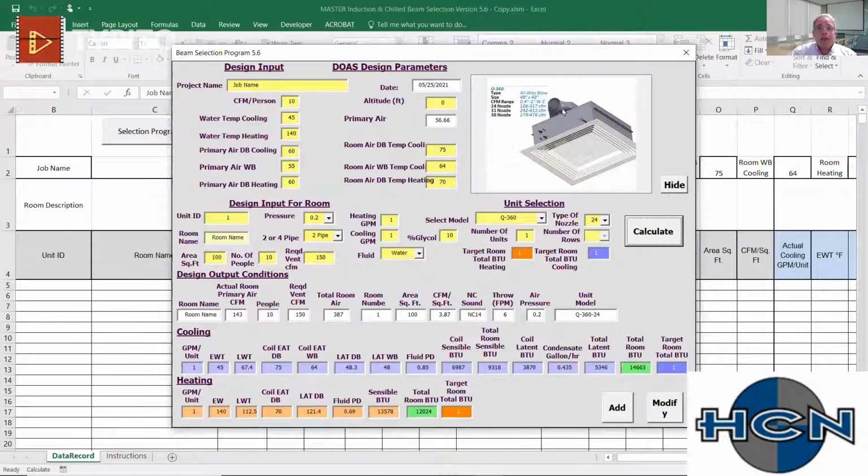And you would measure that static pressure at the exact same place ETL would measure that static pressure. On the low end, it's 143, and on the high end, biggest nozzle at the highest static pressure, 476 CFM of outside air. You'll notice about a 3-to-1 induction rate. So the total air movement in the space is the outside air being delivered and the recirculation that's occurring through the coil.